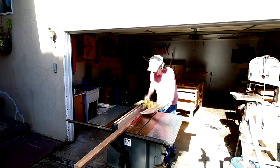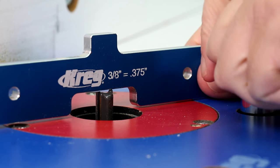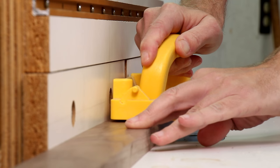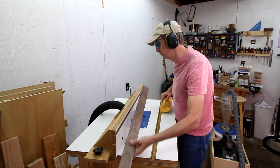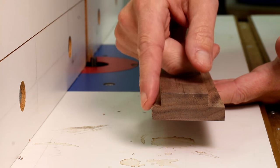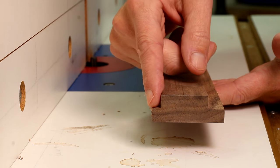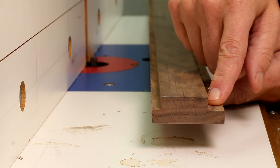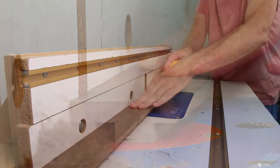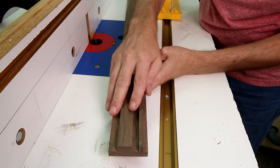I'm going to prepare the inside of all four sides before cutting them apart. I'm adjusting a straight bit in my router to half the thickness of the wood. That rabbet will be for the lid. I'll make a wider rabbet for the bottom of the box, so that gives me a long board with a rabbet on each edge. This smaller rabbet will be for the lid, the top side of the box, and this rabbet is for the bottom of the box. To make the lid it's critical that I cut this third groove exactly halfway through the thickness of the wood. Those are the three grooves for the inside of the box.